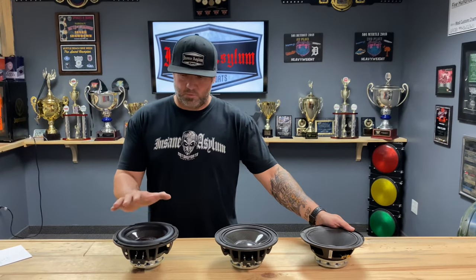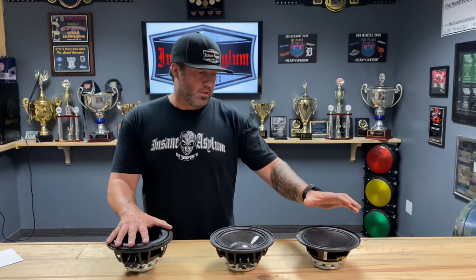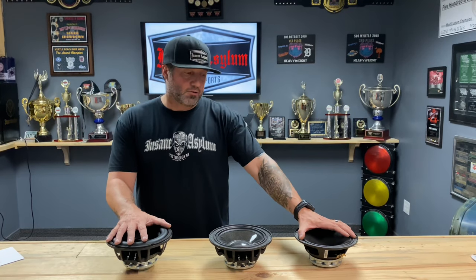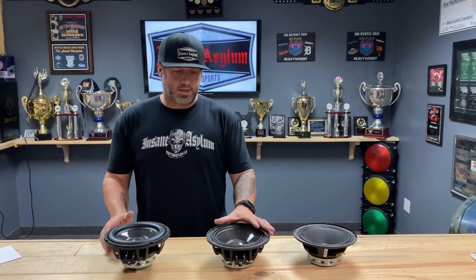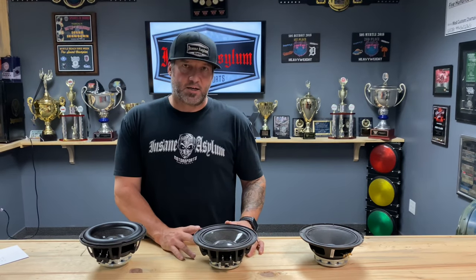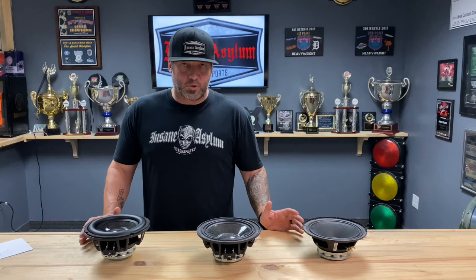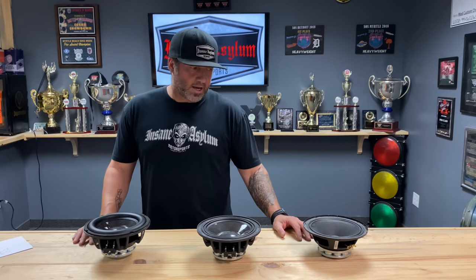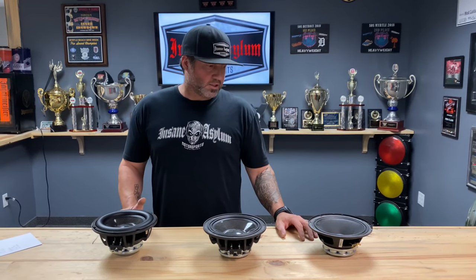For different applications: if you're doing an overall system where you have one of these in your bags or an enclosure, the mid-bass is covering your low end. The paper cone mid is your mid-range — higher sensitivity, so it's going to be louder with more detail because the cone is lighter. The carbon fiber mid covers the lows and is used in an application where you don't have something else covering the lows and you want something to play lower. These still have a lot of detail; they're not going to be as loud, but they give you a fuller sound when you don't have a mid-bass or a sub to go with it.